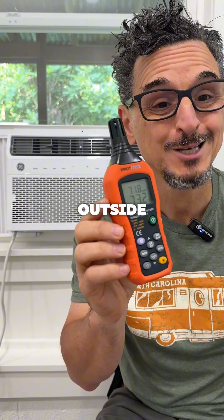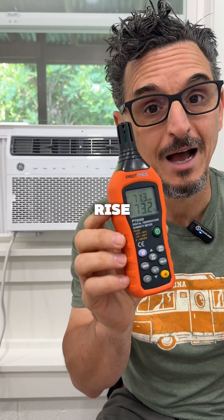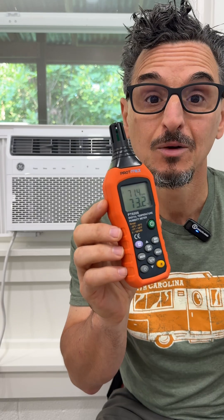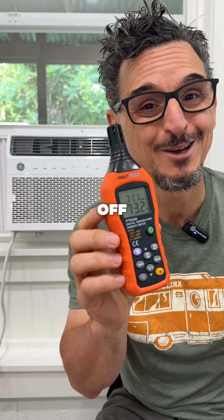It's relatively cool outside — about the same temperature outside as it is in here. As you can notice, the unit is not on. When it's not on, it's not removing any moisture from the air, so the humidity in here is going to rise until the unit comes on. What's going to happen? It's going to come on for a short time, short cycle, and turn off. It will not dehumidify this space properly.